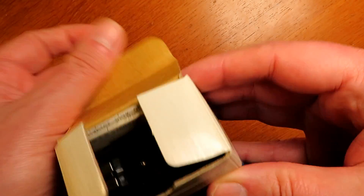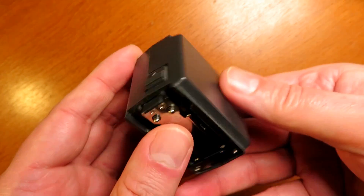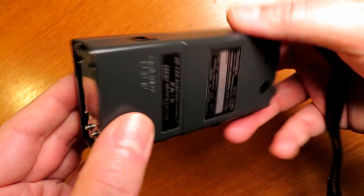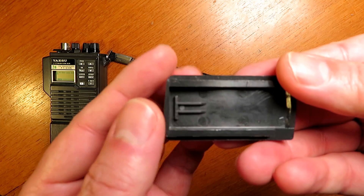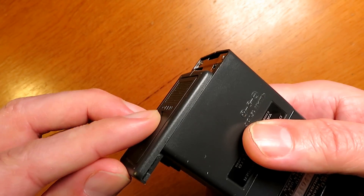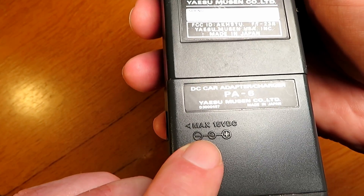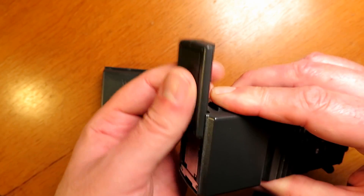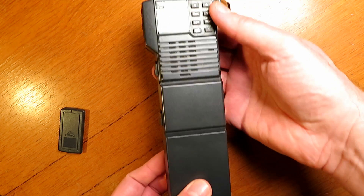The other thing I found in the drawer was the DC-to-DC converter or charger adapter. This was a nice little unit — it sat in between the battery and the main body of the radio and enabled you to run the radio off an external supply of up to 16 volts, while also charging the battery beneath it at the same time. It came with a little slide-on adapter plate so if you weren't using it with the battery connected, you could pop that on the bottom to keep it secure and dust free. It had a DC socket with an unusual polarity: outer positive, inner negative.